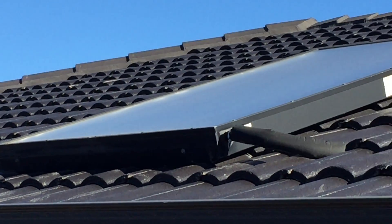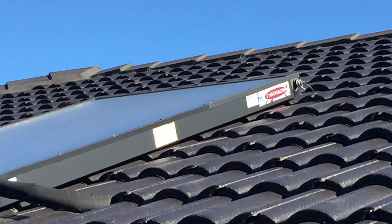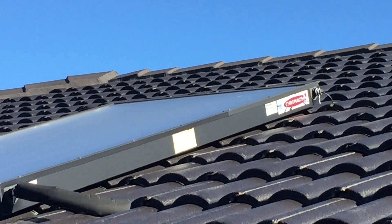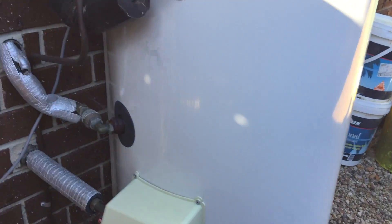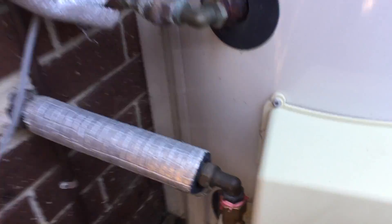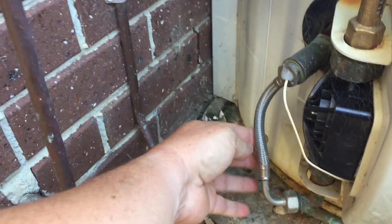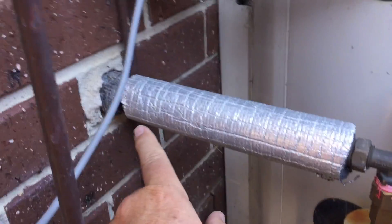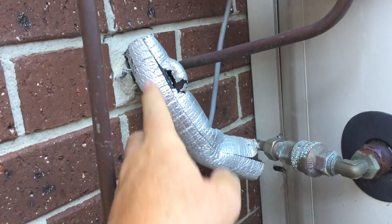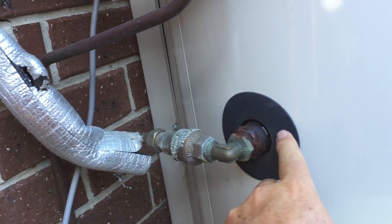So that's the system that's up on the roof - the lower pipes, the area of hot water coming in and going out to your storage tank, and there's a sensor up the top which is simply checking the temperature. Coming back to the hot water service, what we have here is the storage tank. The water draws out of the tank here, it goes through this flexible pipe and it goes into the motor. This is the base of the motor here and it drives up then going up onto the roof. And then here is where it returns from the roof - look for your insulated ones, they should have the hot water in them. So it returns from the roof here and goes into the tank.